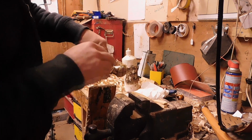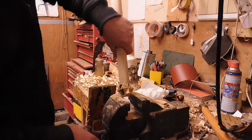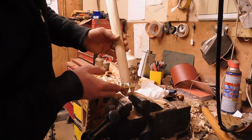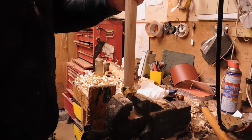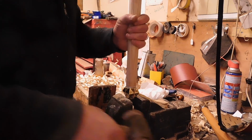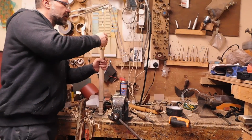That's all nicely seated. I'm just going to make sure that this mace head is well seated on the shaft. So I'm just going to put it there. What I've done is I've opened the jaws wide enough so the end of the shaft will go down through the jaws, and I'll whack the end of that with a hammer and just drive the whole thing down very hard. So here we go. So that's it now. So I'm now going to drive the largest of the wedges in.